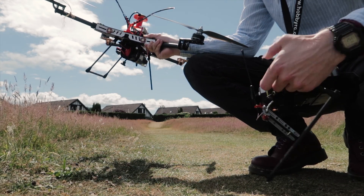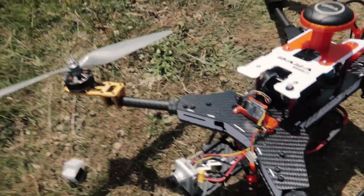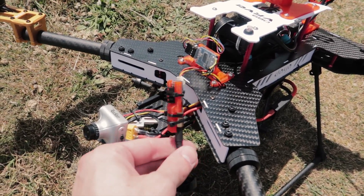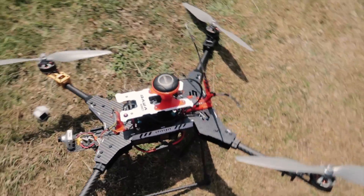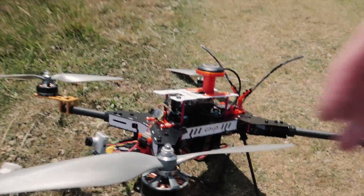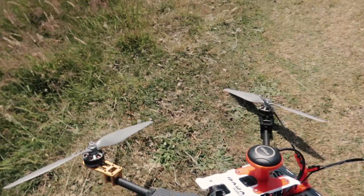And that is why we always record these first flights. The PETG 3D printed parts are not as strong as I thought they'd be — the VTX mount has broken at the bottom and the GPS stalk has cracked as well. But otherwise the motors all seem to spin smoothly, so that's good enough.